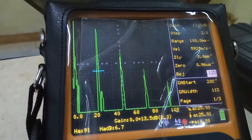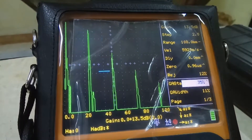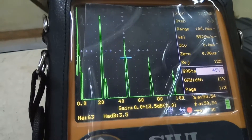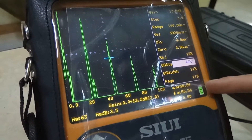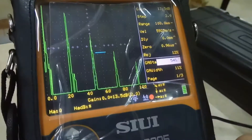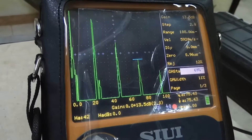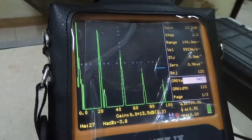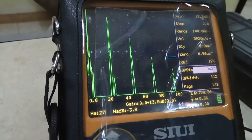Since it's already at 25, we're going to check whether it will be the same for the next reflections. The gate is checking the waves it's intercepting. Moving to the second reflection, we're getting a sound path of 50.5 — pretty close. The third reflection gives us 75.4, and the last one reads 100.3 millimeters, which means this calibration is pretty much accurate with only a tiny bit of error. Thank you very much.